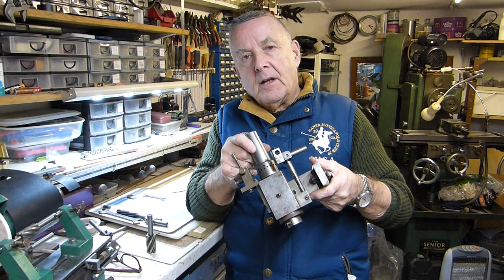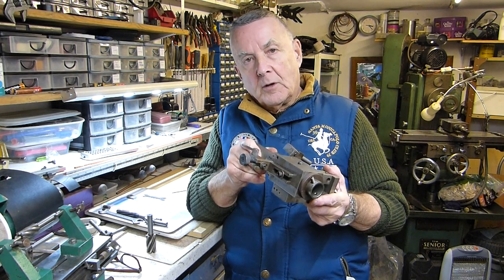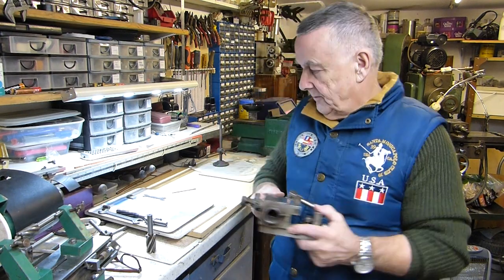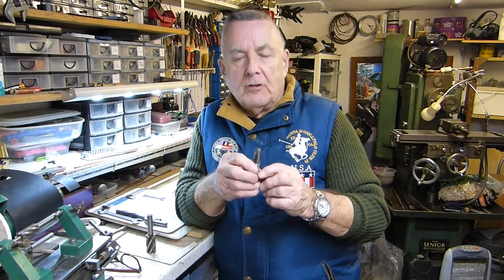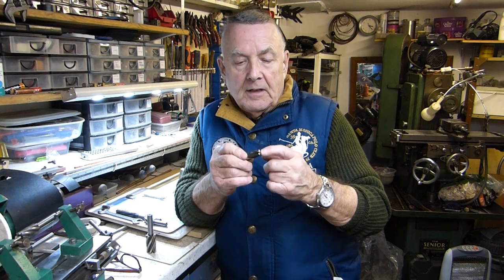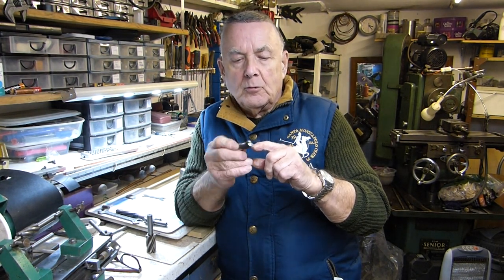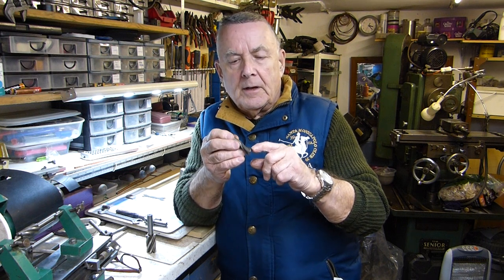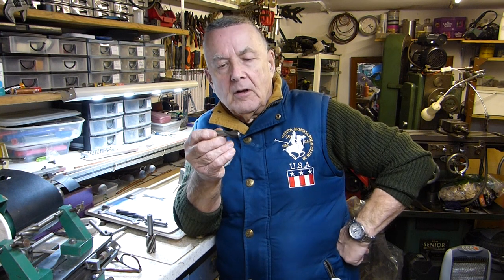This particular one I also made for grinding involute gear cutters because it's got a small dividing attachment built into it. It's the same with slot drills — people just grind the end teeth. That's okay if you're going straight down, but if there's damage on the flute it's not going to really improve it, because that's where the wear is and that's where it needs sharpening — on the flutes.